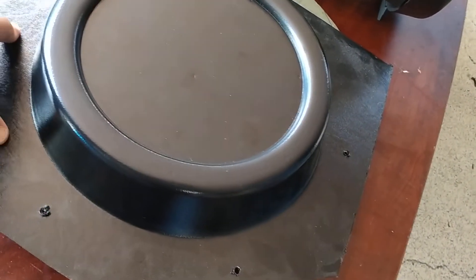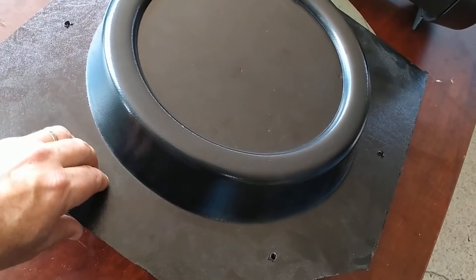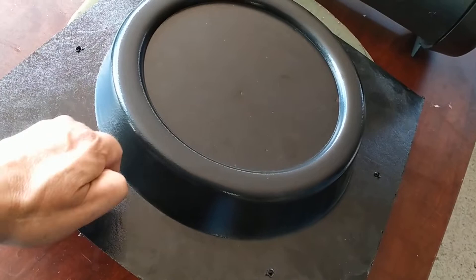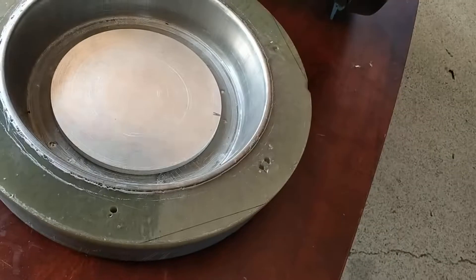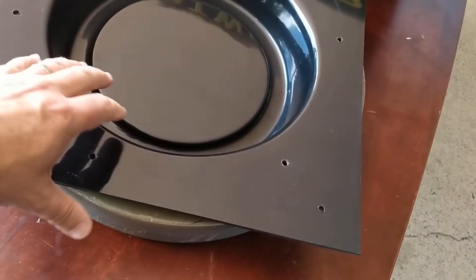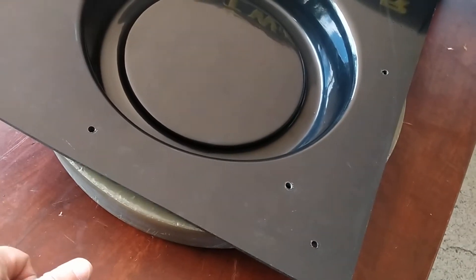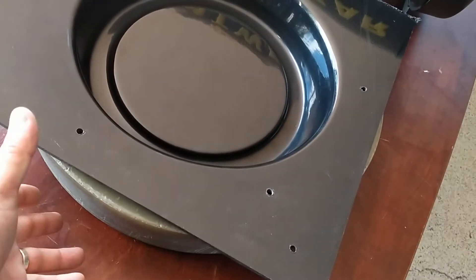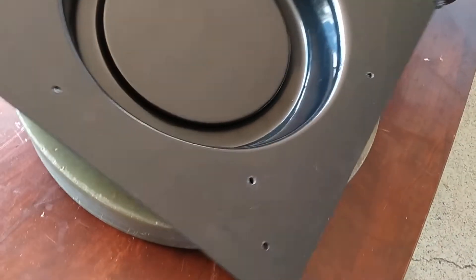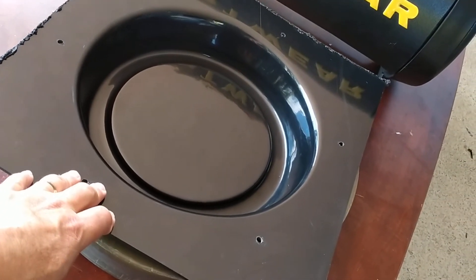As to your sticking issues — I've sent you the message about drilling the hole and using compressed air. In this one, if I pull this down to the full 30 inches and it's sucked down, and then I open the valve to atmospheric pressure, the inrush of air just blows this part straight up and ejects it — pops it straight out of the mould. So that's another plus as well.